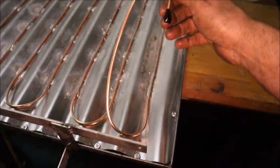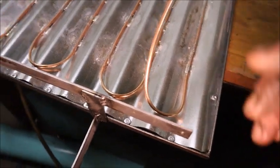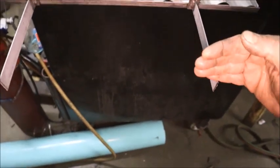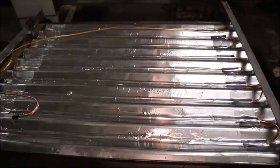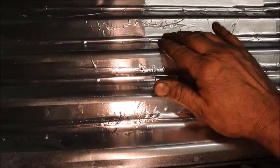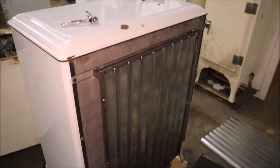This will be the outlet — a dryer mounted right here; the cap tube will come from under the cabinet and connect to that dryer. This is the hot gas line from the compressor. I ordered a new compressor — it's Chinese and cheap but it's new. These two prongs coming down are extra long; I'll cut them to length when the new compressor arrives. Got the aluminum thermal conductivity tape in place to help the tubes transfer heat to this plate. That's a test fit on the cabinet — I think it looks okay.